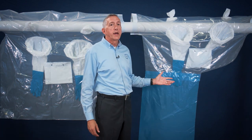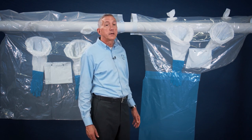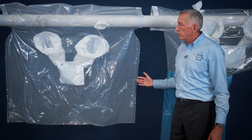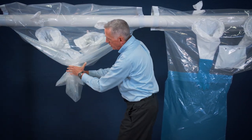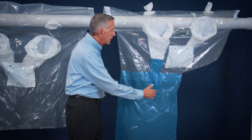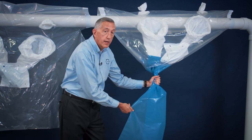However, the most efficient glove bag is the QT style bag. Due to the long narrow debris chamber, this bag can be attached to the pipe fully stretched out to provide up to 50 inches of work area, which is almost twice the area provided by the 44 by 60 bag and 10 inches more than the 54 by 60. The 54 by 60 when fully stretched out to 50 inches does not allow enough room to adequately gather the bag, twist it off, and separate the debris area from the work area. Whereas on the QT-10 fully stretched out to 50 inches, there is still plenty of room to gather, twist off, and separate the work area from the debris area, with room for actually 50 inches of debris.